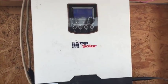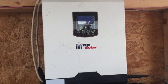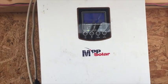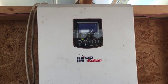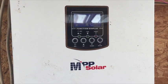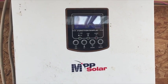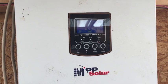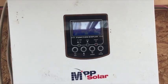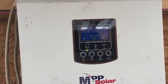So far I'm pretty pleased with my MPP Solar, though I wish I had sprung for the MPPT version. I'm currently considering a $60 MPPT charge controller I found in California and hooking that up directly to my battery system. I've seen other videos where people with the 4048 version can calibrate it to a specific charge voltage for 18650s, and I don't want to overcharge them — I just need to calibrate to 25.2 volts.